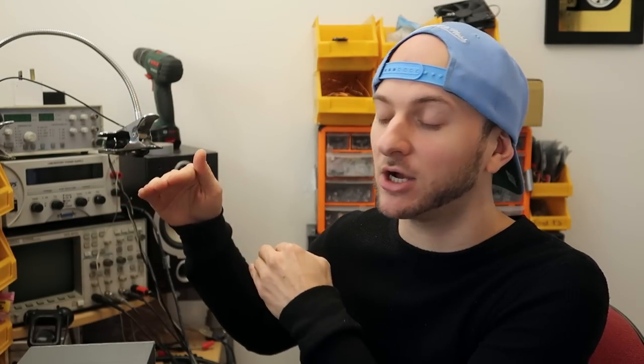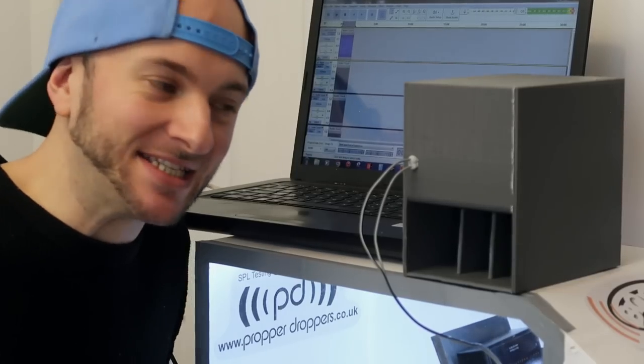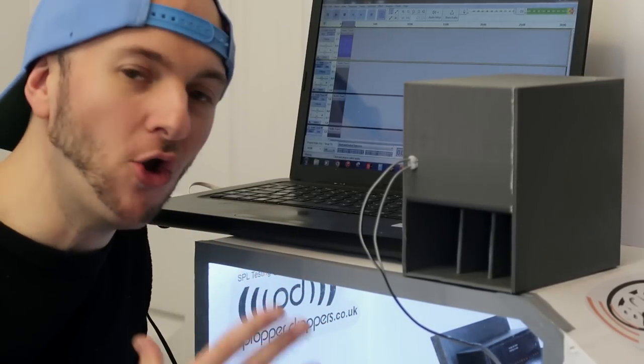And the reason that these impedance peaks get smaller as it goes up is just because the driver itself, when it's unloaded, is presenting less impedance rise as the frequency gets higher. Impedance rise is as a result of the coil moving in the magnet. So if you've got less excursion, you're going to get less impedance rise anyway. So you're going to get more excursion at the lower frequencies, hence the massive peaks down low, and then less as you go up. That's interesting stuff, but what does she sound like here, open on the table?